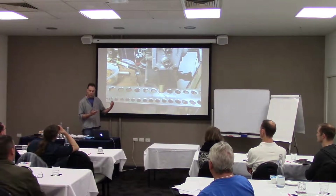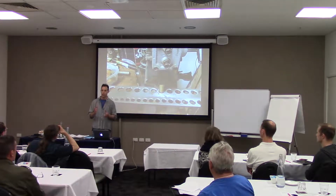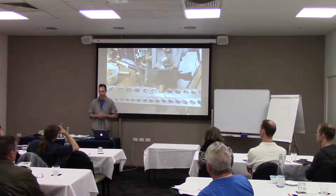And then I take a measurement of the inside, and I know what I need to get to. I take a measurement of the outside, and then I just subtract by what I need to bring it down to. Sometimes you might have to open them up, but that'll get you there. So I make my own outer slide tubes for the box that way.